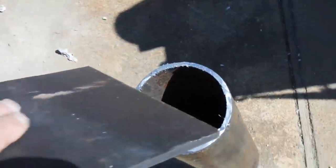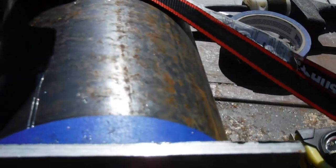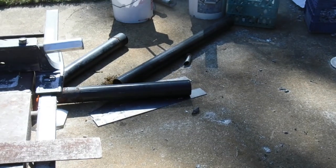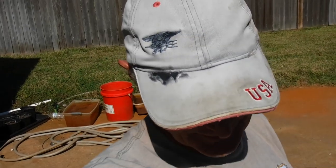That base plate cut wasn't quite as straight, but it's not critical — it's just gonna sit on the base so we can weld to it, so we're okay. We've got one done. I may attempt welding — we'll see how it goes. I am a welder, so I'll cut a couple more out of this pipe and test one out. It takes a lot more work than just walking out in the field and pouring aluminum — there's a lot of preparation involved.